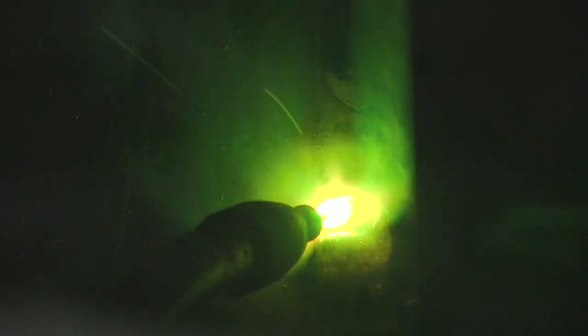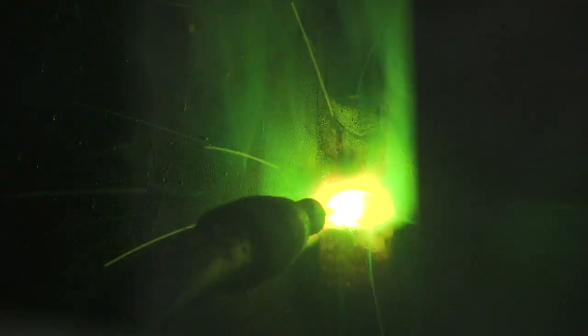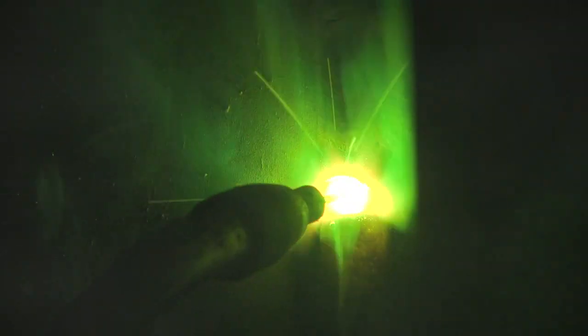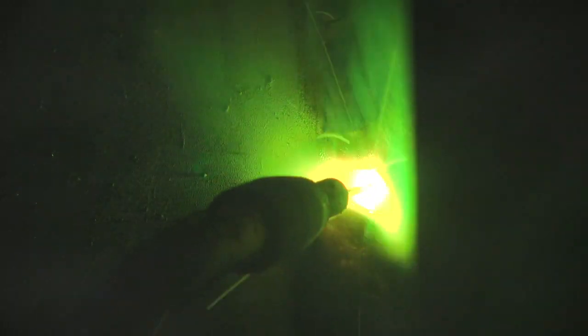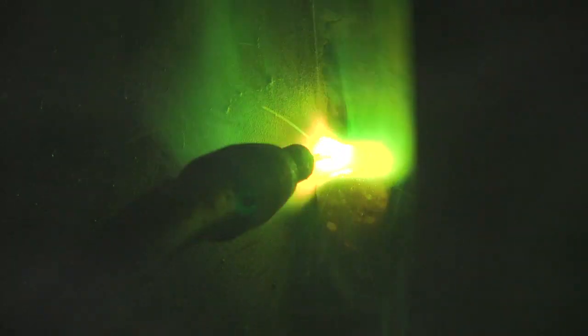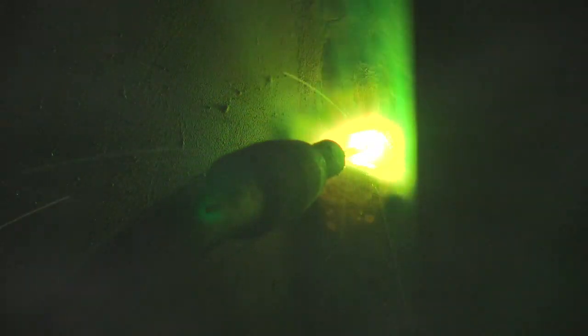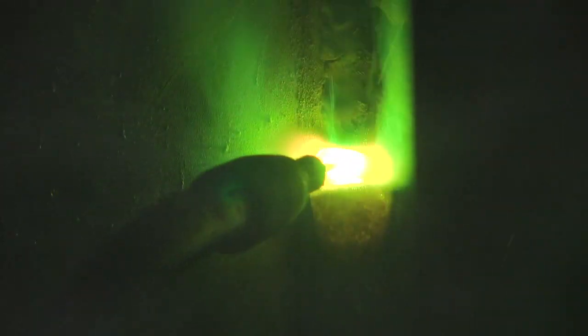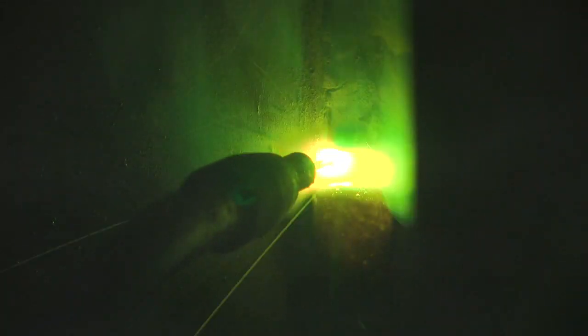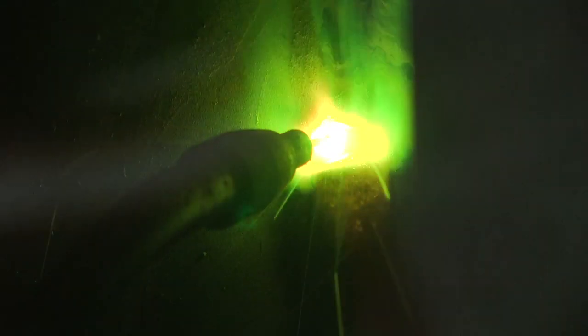This wire is called NR233 — a very high-deposition wire, even out of position, vertical up like I'm running, or overhead. It's the slag system that's the key to this wire. It's a heavy slag that holds a lot of molten metal up against gravity. The key to welding with it is controlling this slag — you actually almost watch the slag line behind you. You want to control it and not allow it to run ahead of the puddle. I'm welding on top of the puddle on the leading edge.